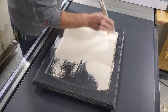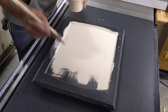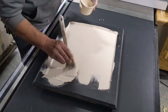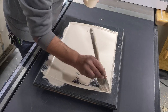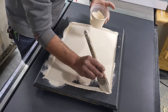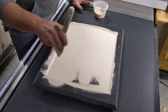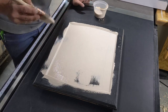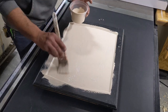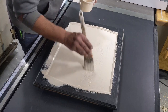Just kind of get it on there and then come back through. As you're coming back through the part that you just painted, you lift the brush off the top. And because this is a first coat, I don't care that it's not completely covering — I'm going to come back and do a second coat. In these corners, you grab a little paint right on the end of the brush, tap it right into that corner, and then pull it back. Just jab in the front there, get that bit covered. Even though it's evenly spread out, I can come back starting where the brush mark will be hidden.